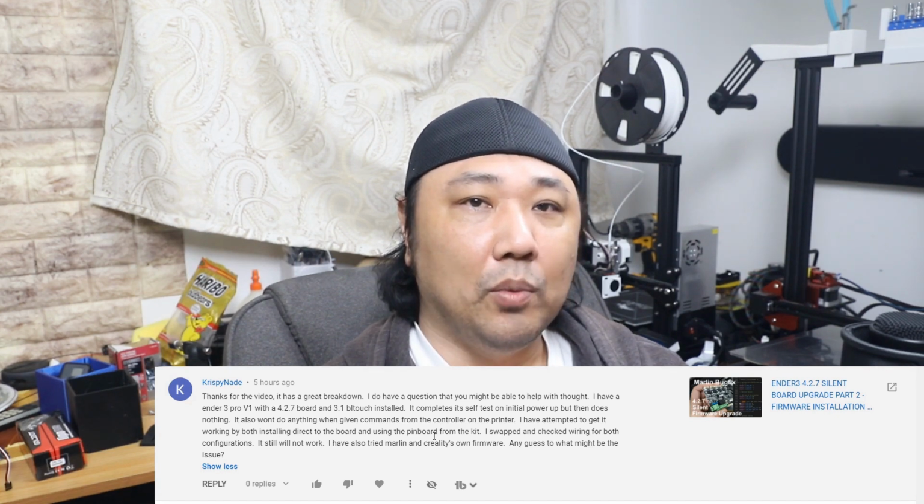See, because it's on the 4.27 silent board right here, upgrade, that you left a comment, but I'm assuming that you're saying that you swapped out the motherboard from the 1.4 board with the 4.27 board and tried it both ways. If you're going to use a 4.27 board, start with that, install the hardware, and find a firmware that works with the 4.27 board. You shouldn't be swapping it out to test whether the firmware works. They're using a different chipset. One is an 8-bit board and one is a 32-bit board.